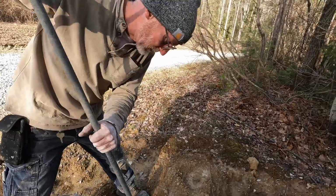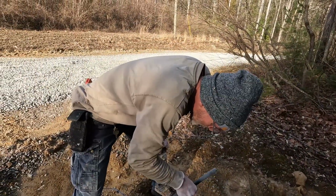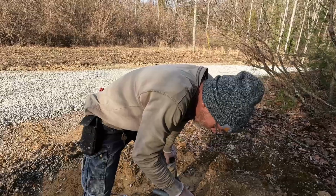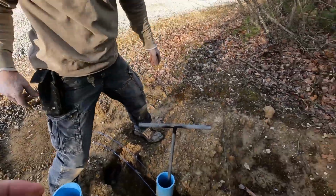Well, that was water I was seeing. Here we made a shutoff tool for the poly valve. It's just a quarter turn valve. So we put that in the center and just checking for leaks here. We did end up having one leak that we identified while doing this test, so we had to tighten up the fitting.